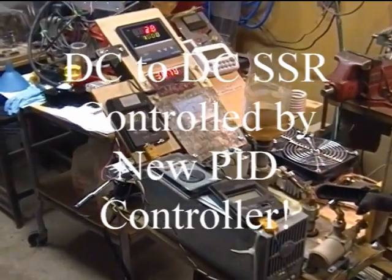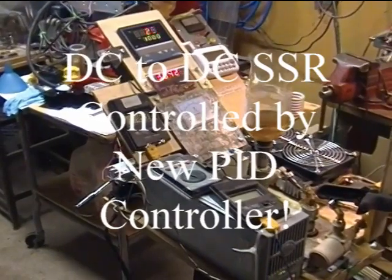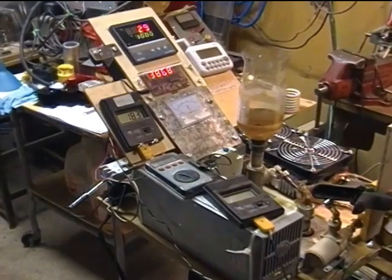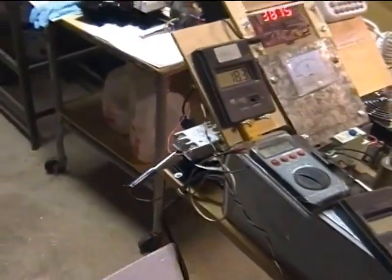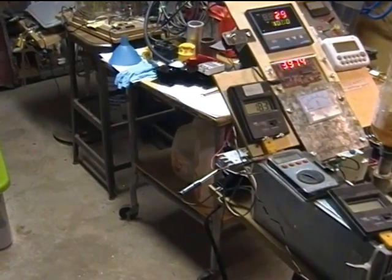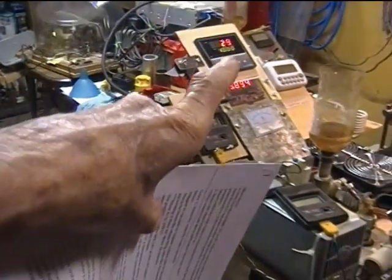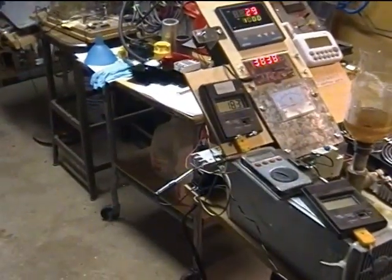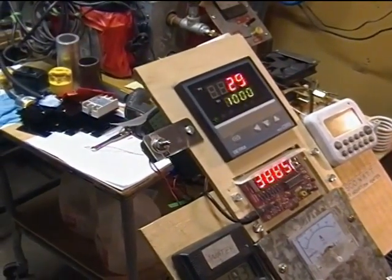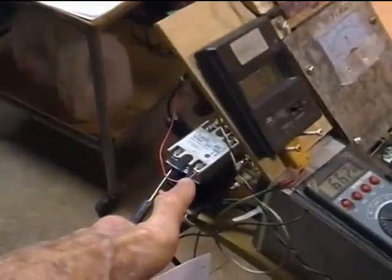What's new today is that we are finally automating the power cycling for the 2500 watt CVS heater system. In the last video I used a simple on-off switch to control my 40 amp DC to DC solid-state relay, simulating how an on-off controller like a PID controller might work. So here I have added this REX C900 PID temperature controller to control the SSR.